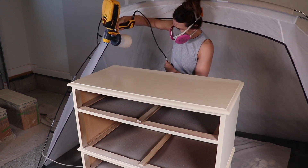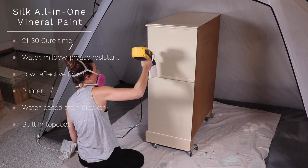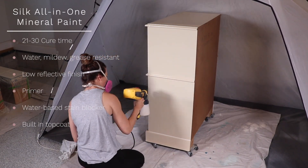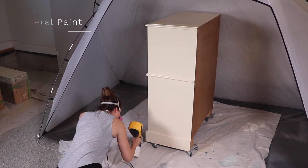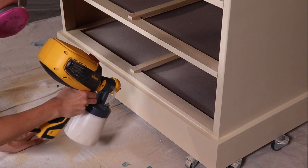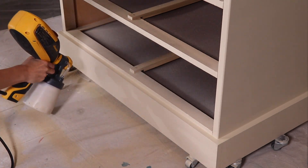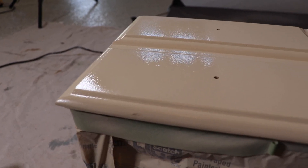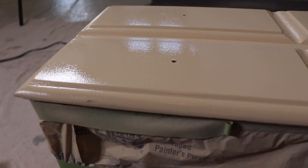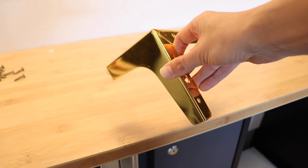Now applying the second coat. This Silk all-in-one paint has a built-in top coat, primer, and water-based stain blocker — which worked great here because I had zero bleed-through. Once it fully cures in 30 days it will be water, mildew, and grease resistant, washable, and have a low-reflective finish. It also has really great leveling properties — the spray looks like orange peel when wet, but as it dries it becomes flat and smooth.